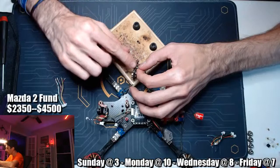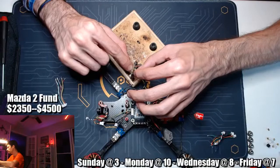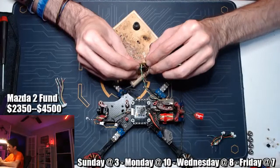If the wire's backed out and there's a big gap between the silicone insulation and the PCB, all you got to do is grab that wire, push it forward a little bit, and just touch the tip of the soldering iron to the back of the pad. It'll liquefy the whole thing, and then you can just push the wire in a little bit. That kind of happened with the yellow ever so slightly, but it's not enough to warrant doing that. It only pushed it out a fraction of a millimeter.